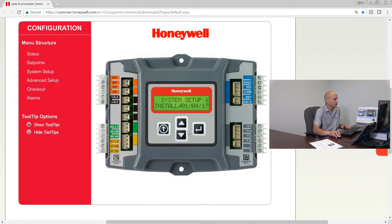I'm going to scroll through each of these options and explain what they mean. Some of them will be really easy — for example, Fahrenheit versus Celsius we won't spend time on. The equipment setting, the third option, gives choices of conventional and heat pump. Conventional is going to be either a gas heating system or an electric heating system, whereas heat pump would obviously be a heat pump. Most systems here in the Midwest will be conventional.